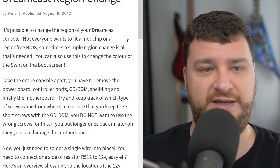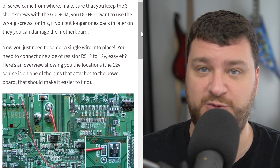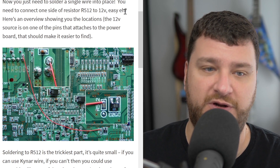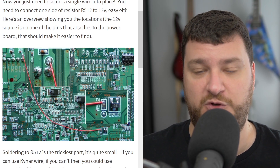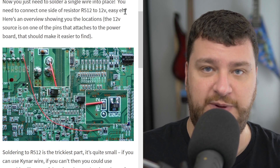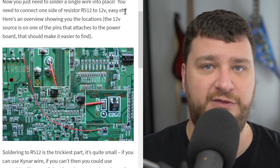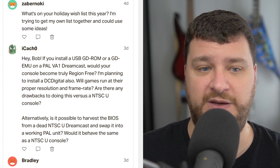Pete from mMonkey did a guide on this eight years ago. According to the guide, it looks like you just need to add one wire from one resistor to one spot on the motherboard in order to switch back and forth between NTSC or PAL. If that's true, you could install a switch — power off the console, flick the switch, power back on. I would actually unplug the console rather than just power it off. But this would only matter for 15kHz games — 240p or 480i. If you're running in 480p, it wouldn't really matter anyway.